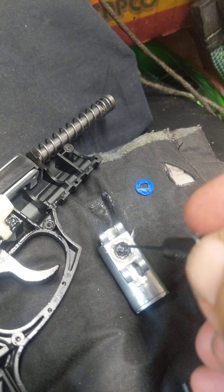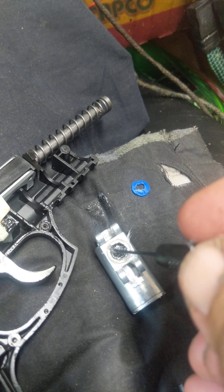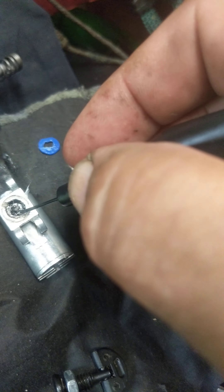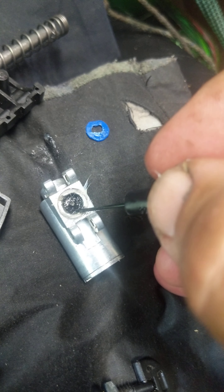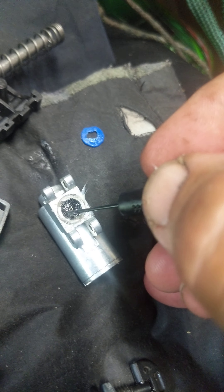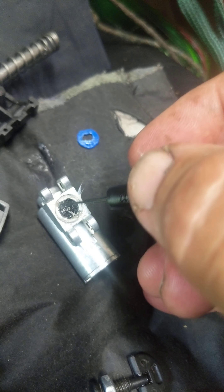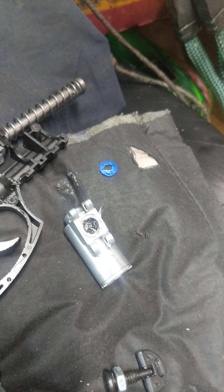Now this nut — when you tighten this nut down, if you tighten it down and you hit a dead stop where it just feels like it suddenly stops and won't go any further, you probably have the same problem. Take this out, put the shim behind it so you get more compression on this washer. What it was doing was going past the piercer, going in behind the shield and coming out at the edge underneath here — I thought it was coming out the piercer, but it was coming out at the edge, because this nut cannot compress the seal any farther than where it stopped. In other words, they didn't bore the thread deep enough.